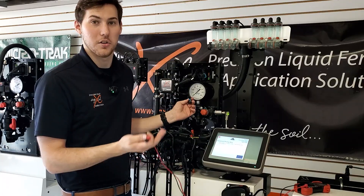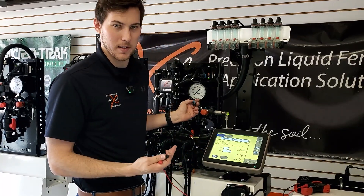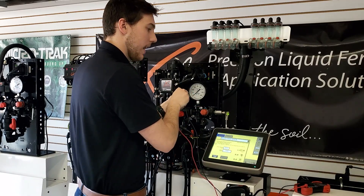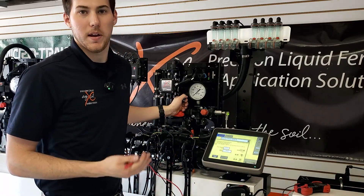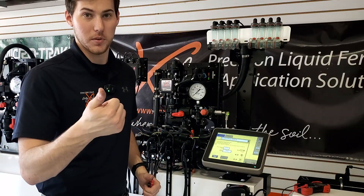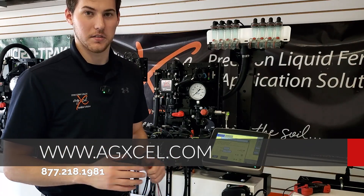I know my harnessing is good, so the PWM is probably the problem. But say if I did not have voltage on that line — let's pretend the controller is turned on and the pump should be running. If I check for voltage on that line and I have no voltage there — 0.1 is basically zero volts — then I know I have a problem with my harness: either voltage isn't getting through to the PWM so it doesn't know to turn on, or the rate controller itself isn't sending voltage out because there's either a problem with the rate controller, maybe your implement switch is stopping the signal from being sent out, or some other setting. So a couple of different things to look for on that PWM side.